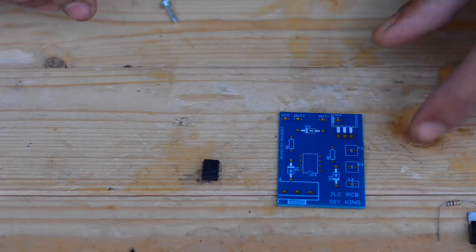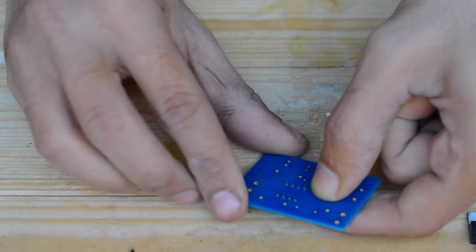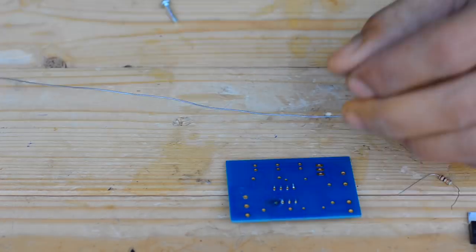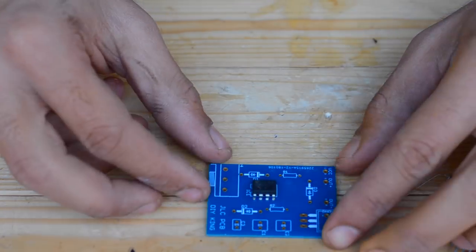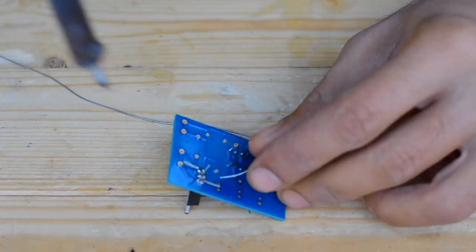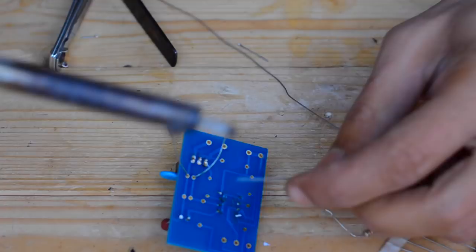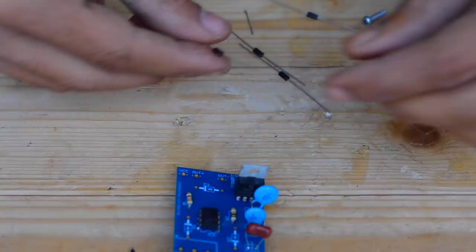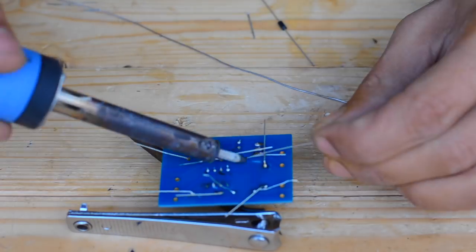The heart of this circuit is a 555 timer IC that switches on and off a MOSFET really fast in order to control the speed of the motor. In one of my previous videos, I built the same circuit by using a transistor which really heats up a lot. So in order to handle much larger amounts of current, I decided to use a MOSFET. For more information about this PWM speed controller circuit, the Gerber files and the schematic, don't forget to visit my instructables on that project.